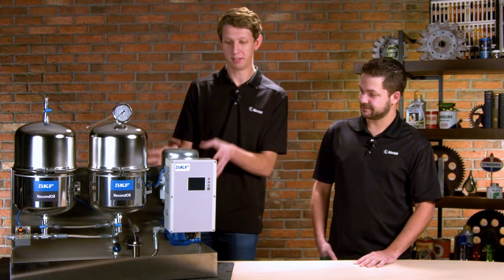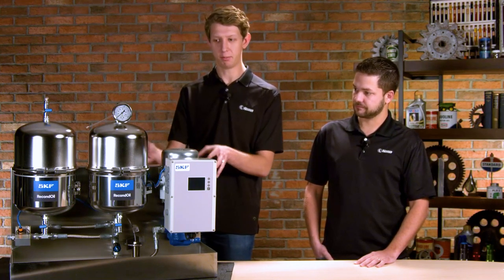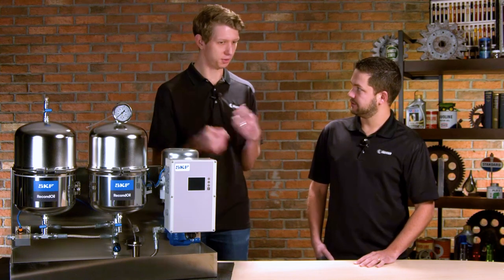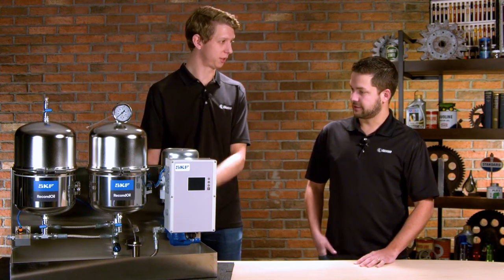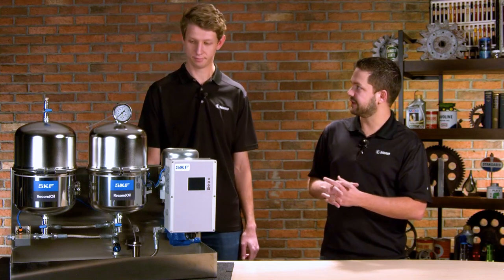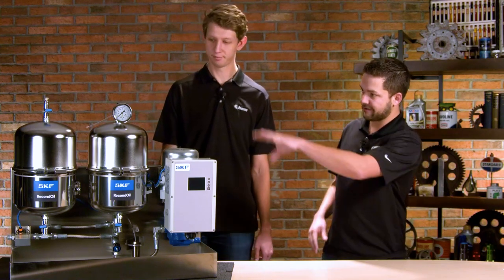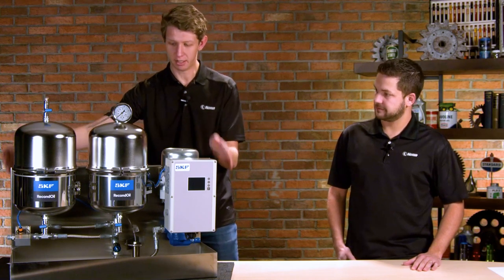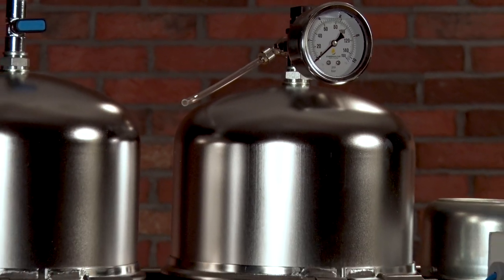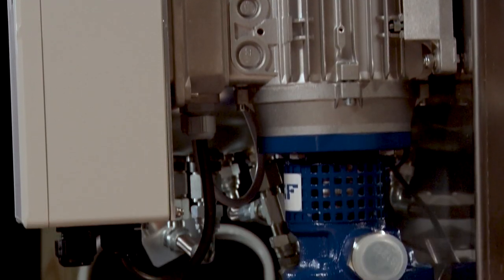That's why this system is different. It's DST activated — it is a filtration system, but these filters are DST activated with a chemical booster that separates out nanoparticles, making them easier to then remove with a conventional filter. We have the overall unit here as an offline filtration system. We've got two filter housings and each one contains a DST activated filter. Here you've got the pump, motor, and the digital controller.